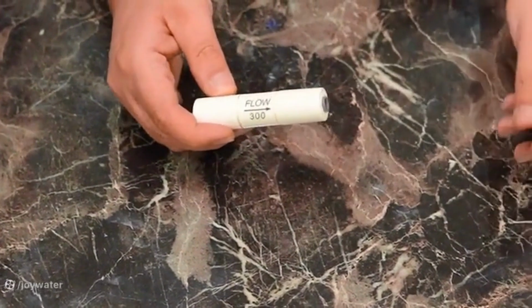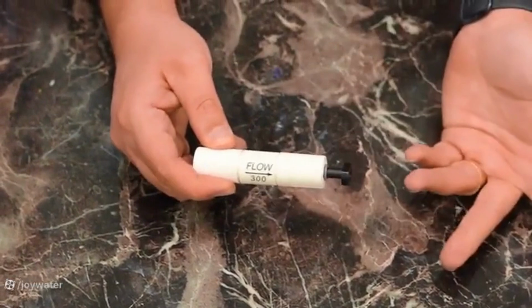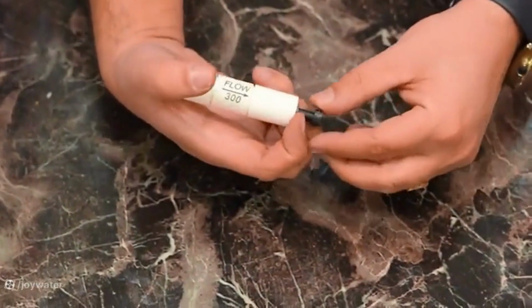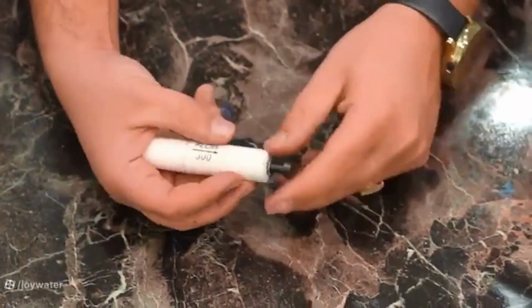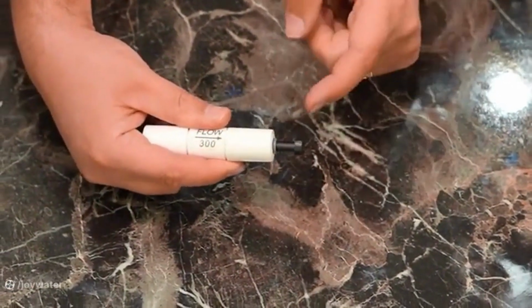The method of working with the fittings is such that when you place or remove the hose or cap on the device, to remove it, you must press this ring around the housing inward to release it. Many people mistakenly pull this part out forcefully without pressing it, which causes damage to the device's fitting component.